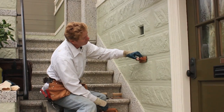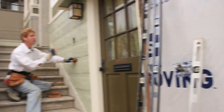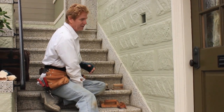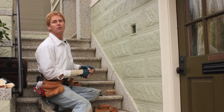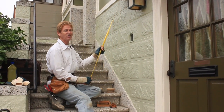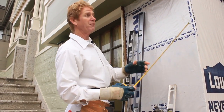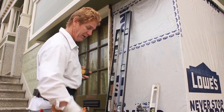So what we're going to do is lath, scratch and brown this, then I'm going to dash it and apply this texture. I'll take my levels, put my levels horizontal, put my lines in with this tool. Fortunately - I can't believe how lucky we got - these grout lines, expansion joints, whatever you want to call them, are in increments of 10: 10, 20, 30, 40. Over here on this side I was going to remove that piece of stucco, but it's a perfect increment of 10, so we're going to leave it.